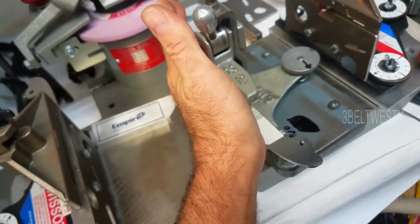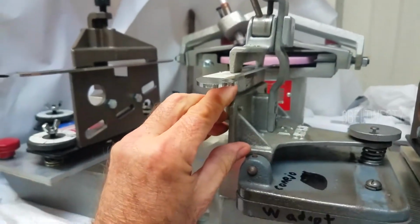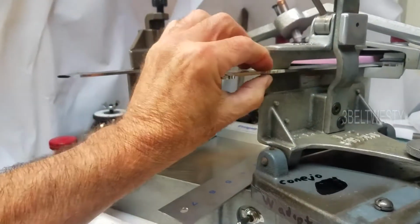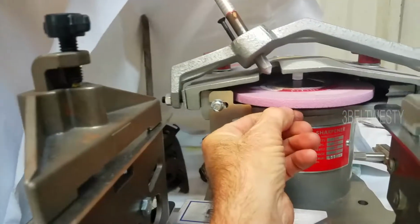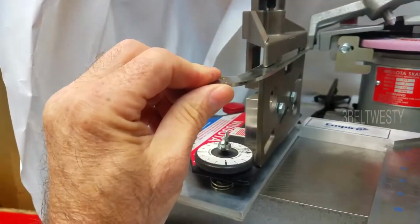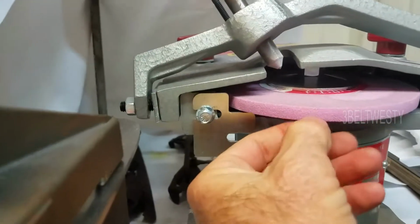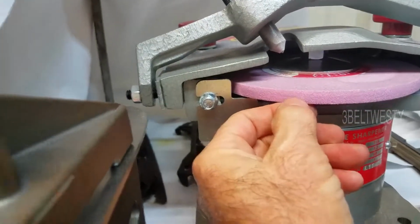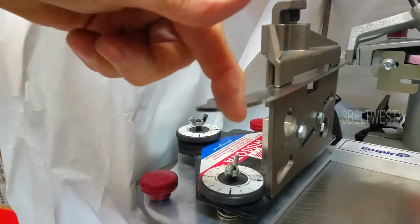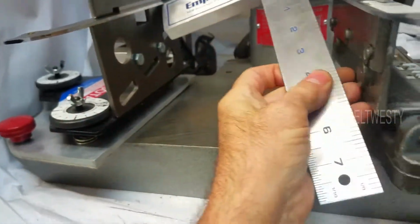That's why, like on the Easy Sharp machine, I believe they set up normally one for figure and one for hockey. And the one for figure, they drop this down a little bit because the blade is thicker. So you want the center of the blade nominally, when this has got no tilt, to hit right through here. Same thing on the Wissota machine. You want it so that nominally, if you're always doing figures for one of those, the center of the blade, when this has got no tilt here, is hitting right where the max bulge is, which is what's cut by the diamond right through here. Then you're not going to get any errors going along here as far as edge thickness. No tilt like this.